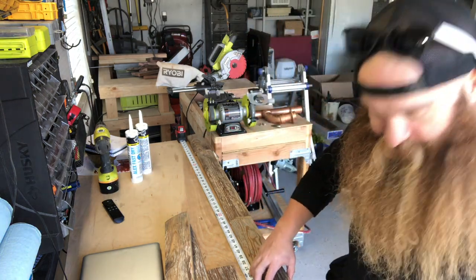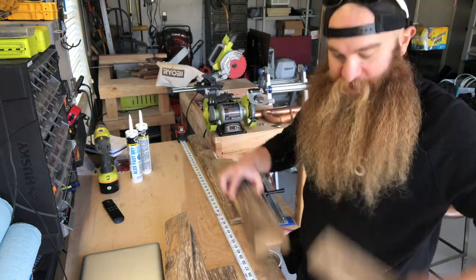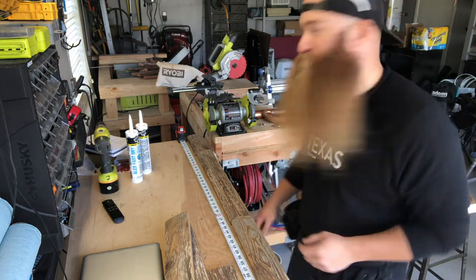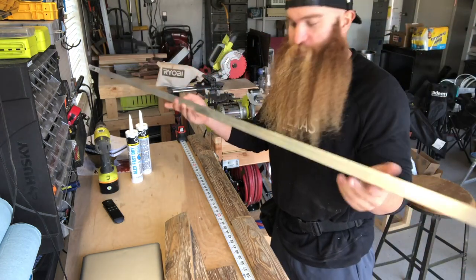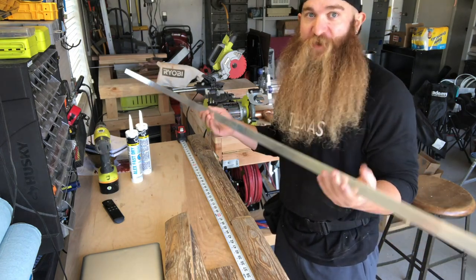As you can see, there are three or four pieces here that are not structurally supporting each other in any way. So how I go about supporting them is I add an aluminum L-bracket to the back — something like this. You can pick it up at Home Depot. Really cheap, really easy to cut and drill holes into. Very strong though.